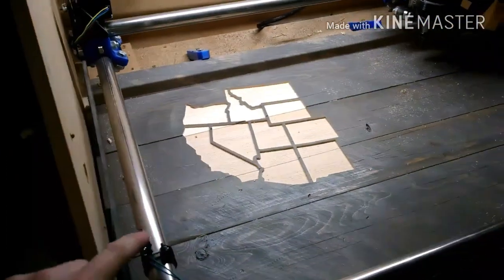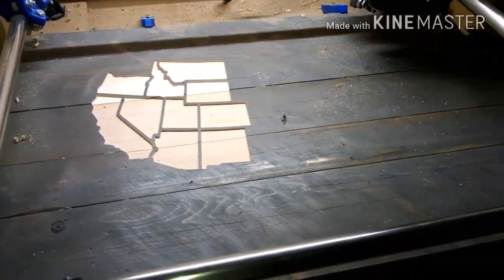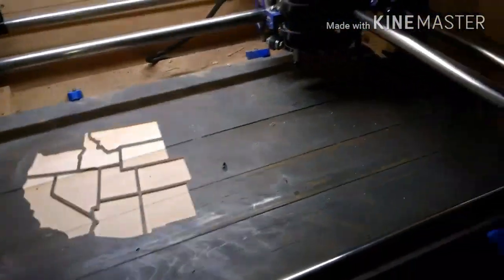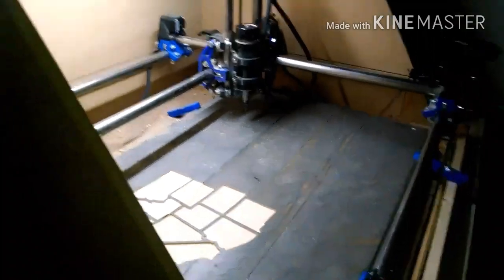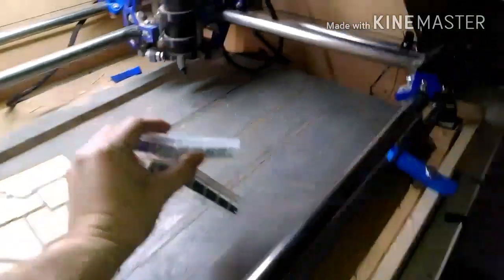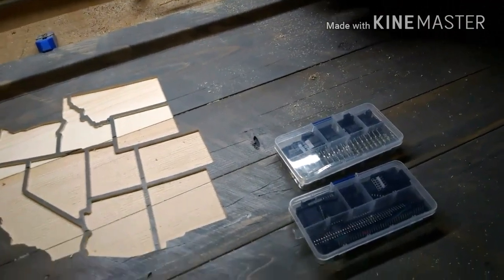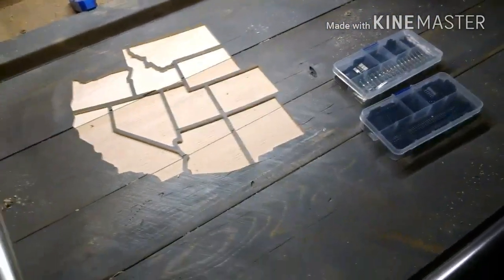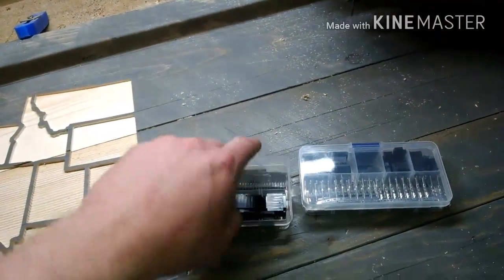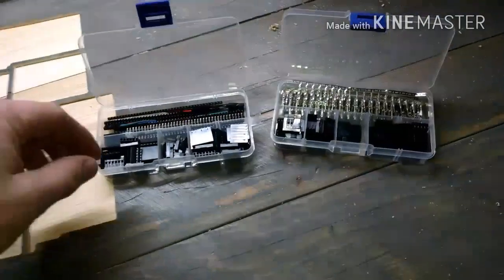You can see what I did — I used the holders that Ryan recommends on the site, bought the end stops from him. You're going to need four end stops, a couple of extra drivers to add to your RAMPS board, some jumpers to go under those drivers, and some wiring. I originally bought just some wire that had ends on it, but they were not the right ends and weren't long enough. But I used that wire to install these, and I bought these little kits off Amazon — really cheap, something like eight or nine bucks for all of this.